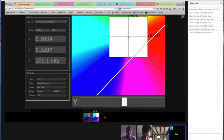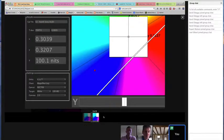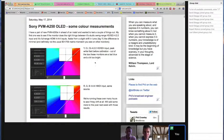The thing you can notice is there's a tiny bit of a luminance offset between the two inputs. I mean, an awful lot less than one candela per meter squared. You won't be able to see that, but it almost confirms to you that we're looking at two different inputs rather than the same input. So HDMI, you're exactly correct, Joel.